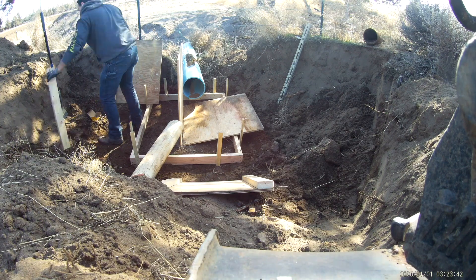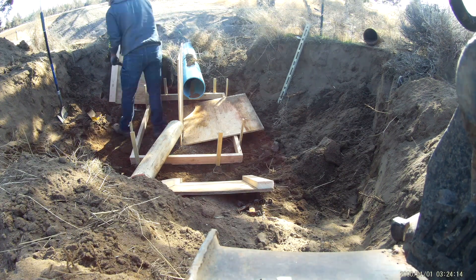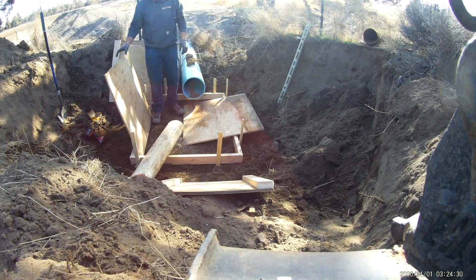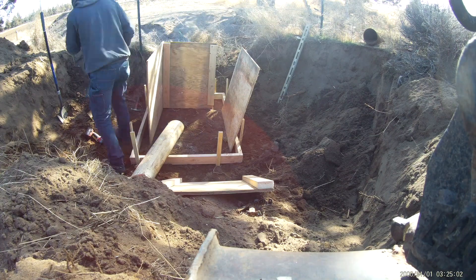For the forms we're doing a four-inch floor, six-inch walls, then we'll do rebar on the floor and the walls, and then I'll make a 3/16-inch steel diamond plate lid with hinges.